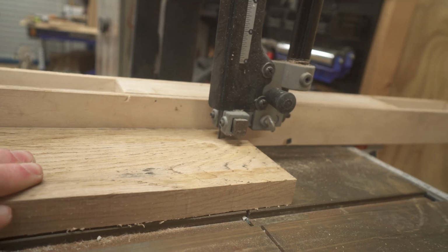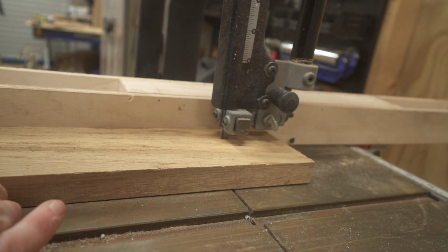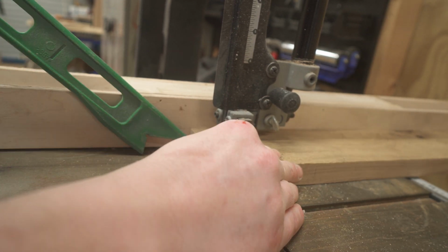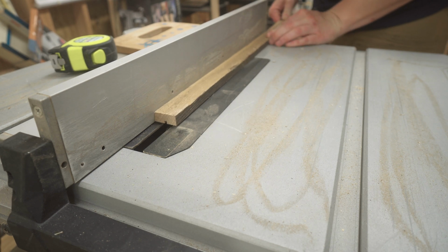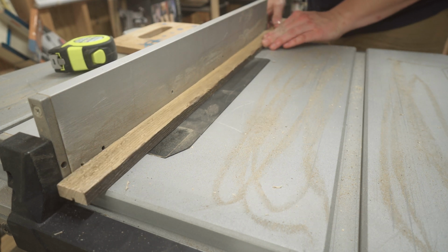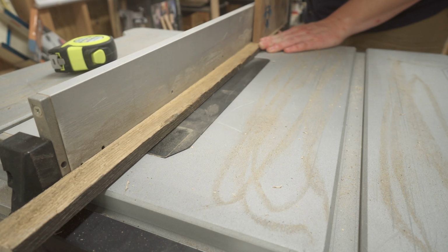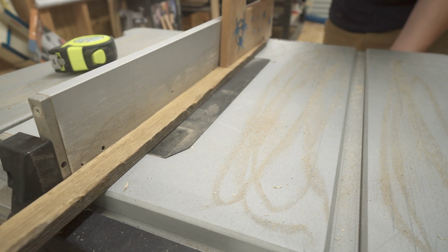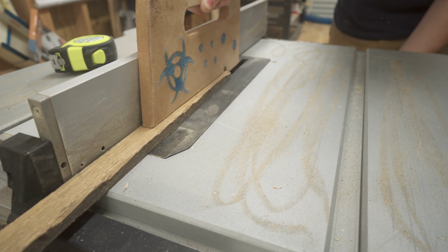After the letters were all laid out, I wanted to start working on the hanging frame for the sign. There was going to be a backboard with the logo cut out, and then the acrylic with the letters on it protruding from that in a 3D type look. But I needed a frame that would, one, allow me to hold the backboard and align everything properly, as well as hide some of the LED strips that would be needed to light up the Lexan and give me the backlight type property for underneath the backboard of the sign.